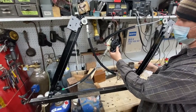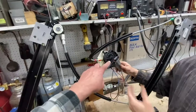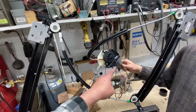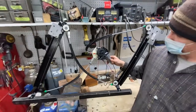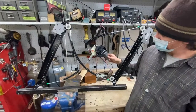So it looks like we're done. We did have to disconnect all of the 62-pin connector to this motor and just do what the computer does — reverse the polarity to these two leads here. We'll put that back in place so that it'll be exactly as it was when it arrived. Thank you for sending us the motor to confirm this, and we're shipping today.